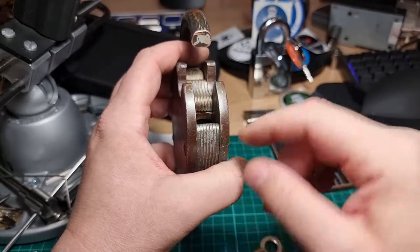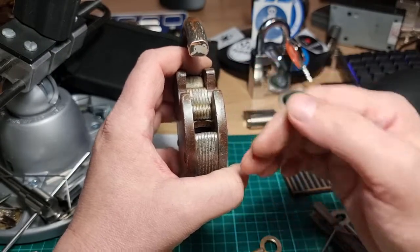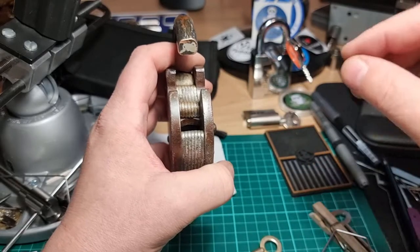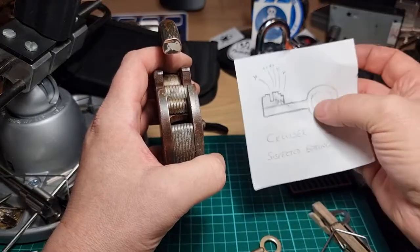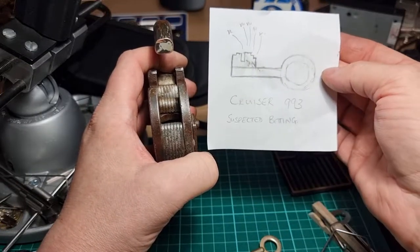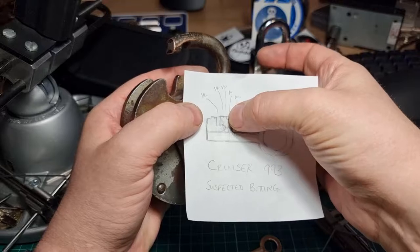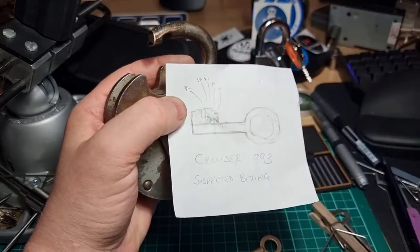But if you look at a shallow enough angle and slide the bolt until those levers lift to the highest point and stop moving, you can kind of decipher the bitting on the key. So I sketched this out. So I knew there was one very low, followed by two very high, and then stepping down at fairly regular intervals.